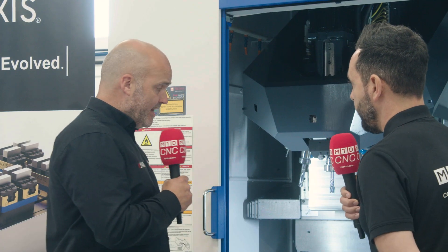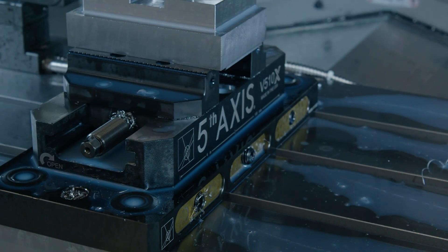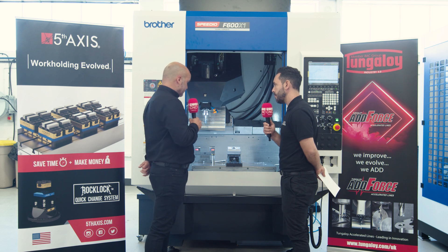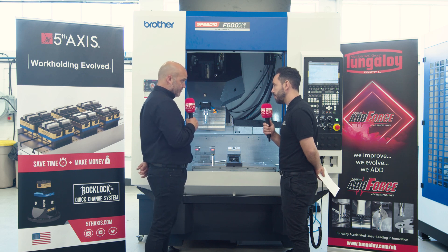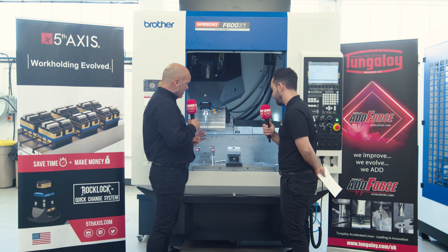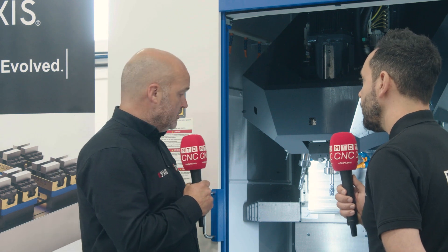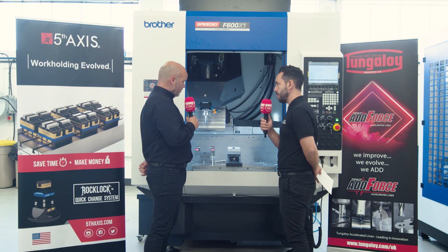Yes, Gio. So today we've come with a solution which is our brand-new V510X, which is a self-centering vice and a zero-point workholding system, which is mounted directly to the bed. We're utilising a dovetail where the jaws are — a dovetail joint — which holds onto the component very, very securely.